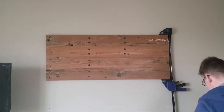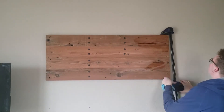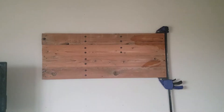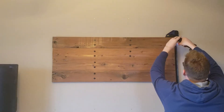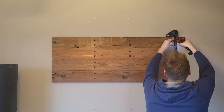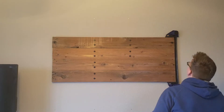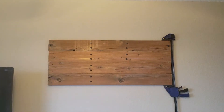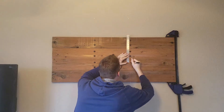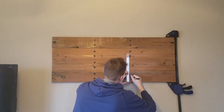It's always good to have giant clamps on hand just in case you need to randomly clamp together a bunch of 2x6s. Clean up the glue drips and the overrun, clean up the end here, throw the clamp back on, and we're going to leave the clamp on for a couple of days while we finish the project. We'll drill that out with a larger pilot so that when we run the lag in, it doesn't split things apart. Making this video a couple days later, I can confirm that the split has stayed not split — it's successfully glued together, so I'm pretty happy with how that repair job worked.